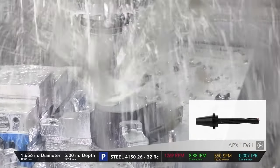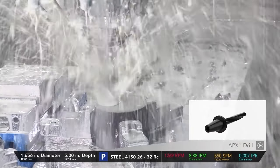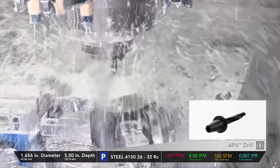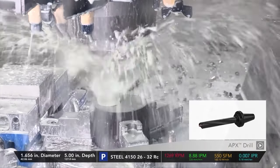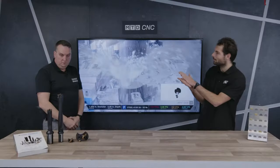If people are ripping out these holes at a low cost per hole, what about the actual resulting hole quality — how do you make sure the surface finish is what you need? You need a good centre insert to start with, but then on the outside inserts we've modified to have a wiper geometry — the wiper will be flat off the corner — and that gives you a smoother hole surface finish. On the 95mm here there's a fascinating extra insert on the outside — what does that do?